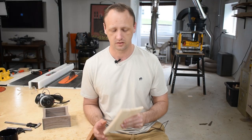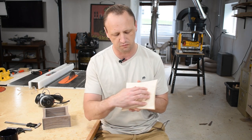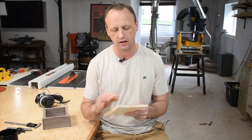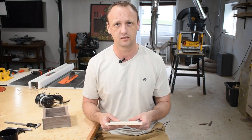I engraved the lid of the box and at this point everything should be done and ready for finish — with one big exception: it didn't engrave correctly. It's woodworking and everyone screws up from time to time. I had this beautiful flame grain maple that I saved specifically for this client, and when I engraved the back, my laser printer engraved it off to the side. Even though I had guide marks and everything looked perfect on the computer, the printer head was out of alignment.